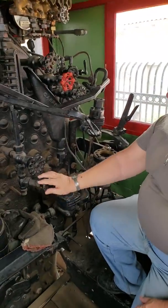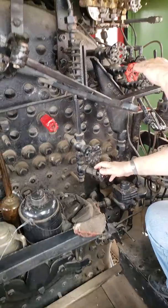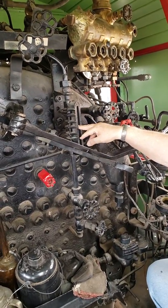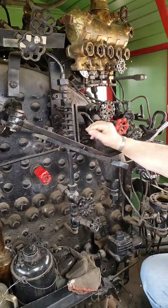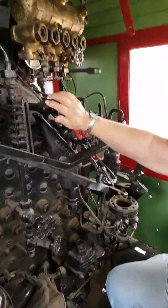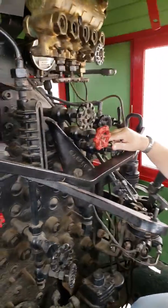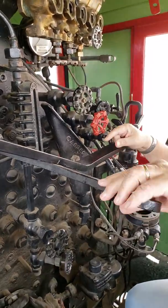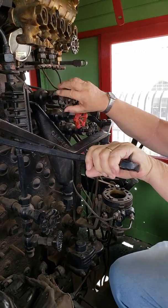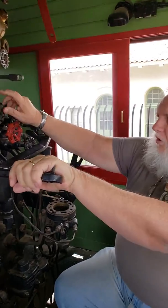And shut it off, and watch for where it bounces to up in here, and it'll eventually stop bouncing. So you can tell your actual water height. Yeah, and that's pretty cool. And those are your tricocks, correct? Those are tricocks. If something happens to both water glasses, you can still use these to tell where your water height is.